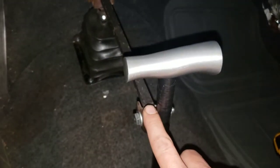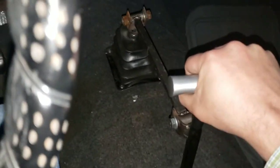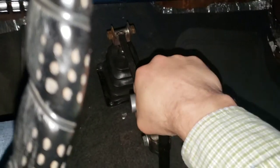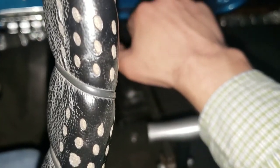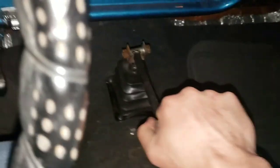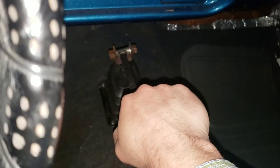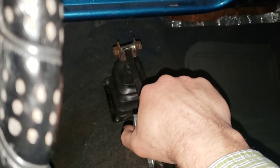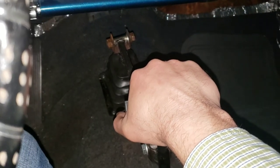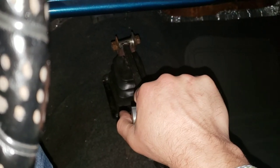As you can see, I welded it here and just screwed my T-shifter on from the other shifter I had. This is a lot better — it's a whole lot easier to find third and fifth, they feel like they're where they're supposed to be, and I don't have to reach. The old shifter sat about here but the shifts were so long. It works out. I didn't come up with this, it's not groundbreaking, but it is successful. It's a whole lot easier to row through the gears, and there's a bit of confidence that you're actually going to go into third when you let out versus fifth. It is kind of embarrassing to wind out 5,500–6,000 RPM in second gear and go straight to fifth. Works for me, it's better — hope it helps someone, appreciate you watching.